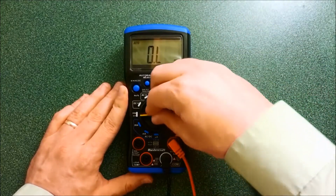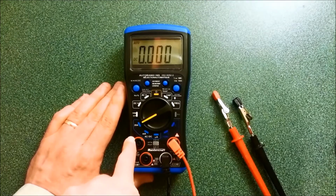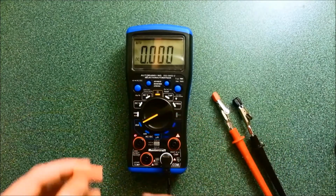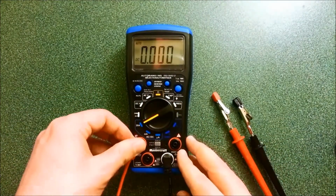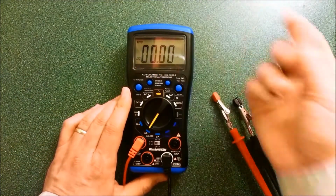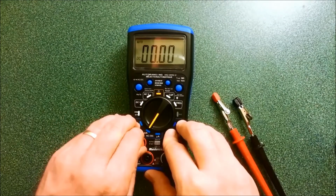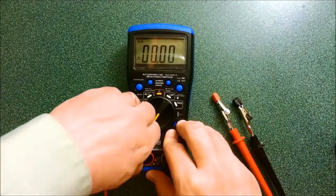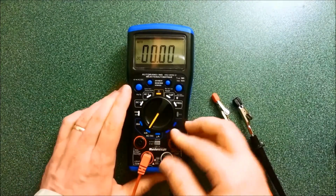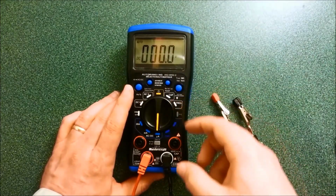the output readings. I'm going to roll this over to amperage. Now we're getting a high tone, and we're getting a flash over here, which is indicating that we have to pull that banana plug and relocate it over to here. And now you've got your connectors in the right position. And milliamps, of course, as you can now see, it's blinking this light, and you reposition the banana plug down to the milliamp position. And now everything is good. And microamps is the same deal.